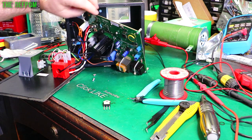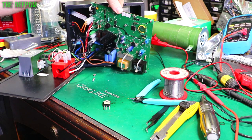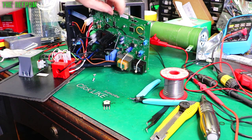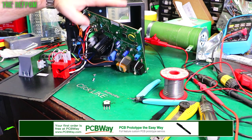But then I lost the display, and I found out what it was - this jumper wire here goes over to this point. It's like a factory jumper, bodge wire. That had come off. I didn't notice - it was still sitting in place but it had broken, made from me handling the board, maybe I squeezed it a bit. That got the display back.